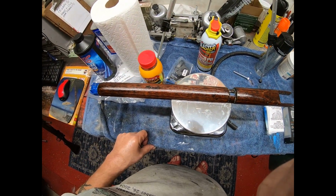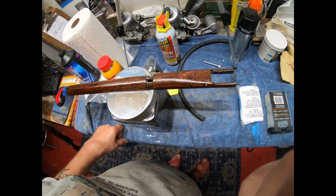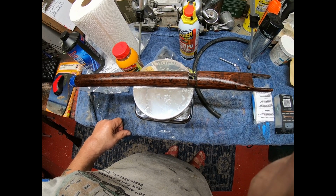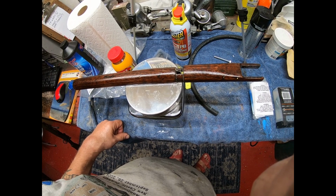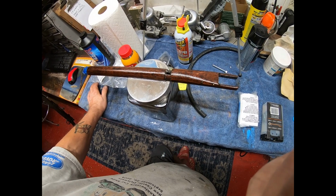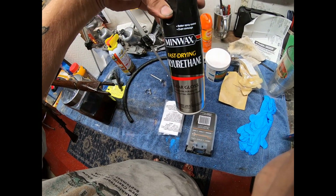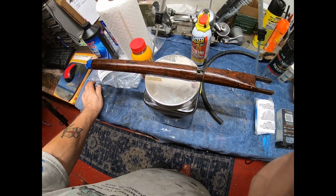This wood now is progressing. I have filled it, sprayed it, filled it, sprayed it, filled it, sprayed it, and so on. At the moment, this is in its fill stage. I've got to wait for this to dry till tomorrow morning. And then once I'm sure that it's set, I will then likely sand it. Now, a little tip: once you've finished lacquering your piece of wood with your polyurethane, maybe lacquer's the wrong word, but you know what I mean, you want to know when it's finished curing so that you can wax it.